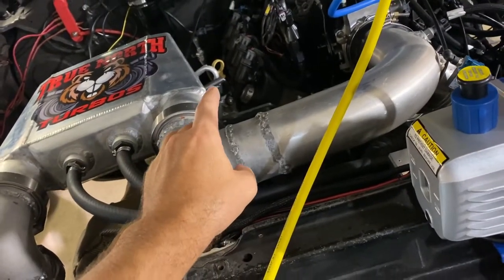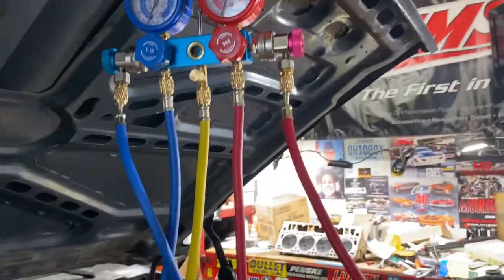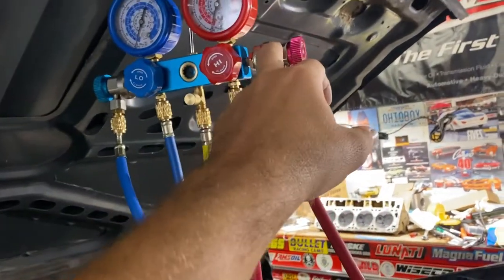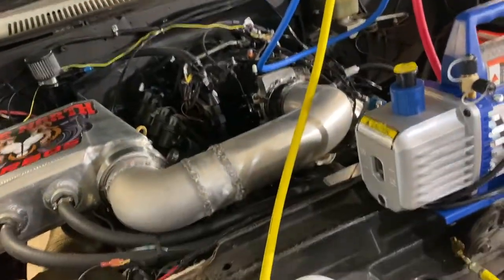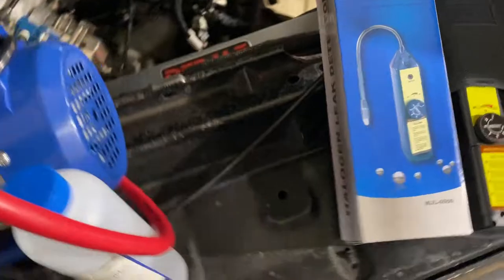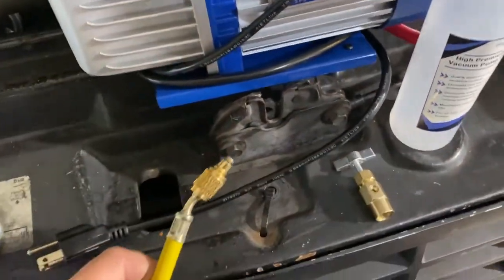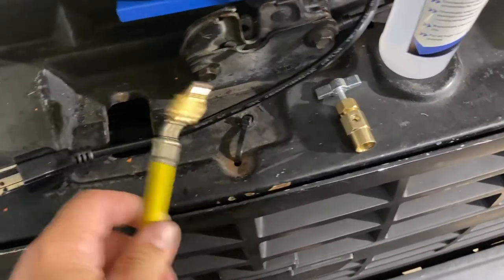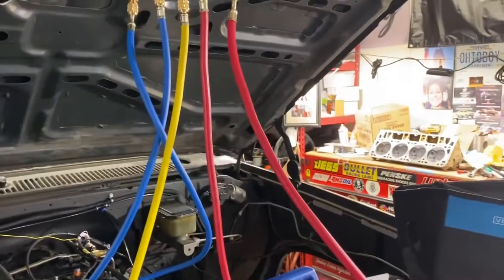It's going to give off a little bit of pressure when you remove it from the low side. The high side will obviously have more pressure and it's a little warmer, so be mindful of that and get yourself some gloves when you go to take it off. The kit also comes with a leak detector and a little carrying pouch. Just be gentle when threading in the canisters — that's the main takeaway. Overall it works great for vacuuming down your system.